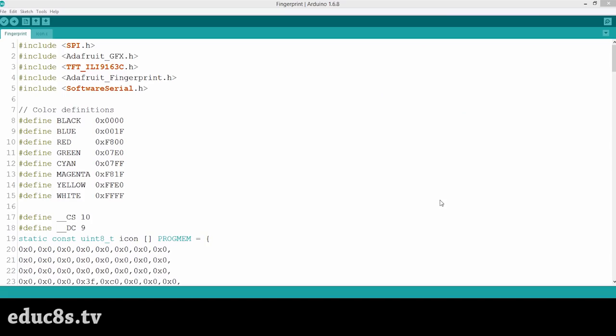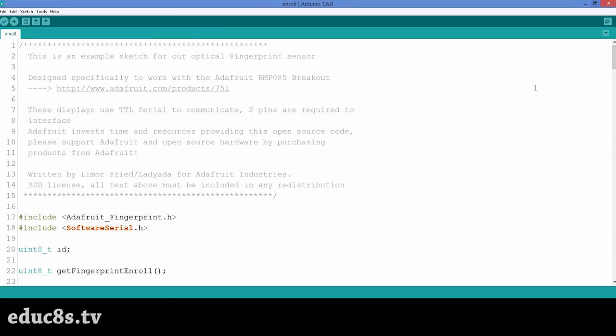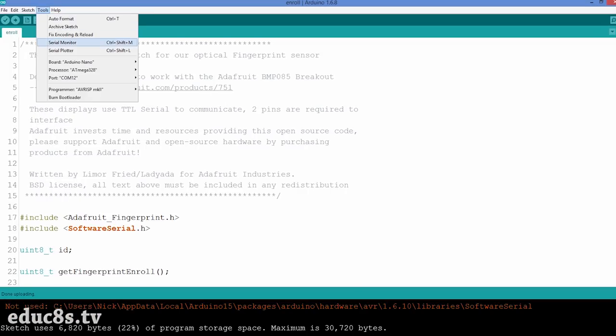We need to download some libraries. First of all, we need the Adafruit Fingerprint Library, the Adafruit TFT Library, and the Sumo Toys Library for the display. You can find links for all the libraries in the description of the video. First of all, we have to upload the enroll example to our Arduino board. We go to File, Examples, Adafruit Fingerprint Sensor Library, Enroll. With this example program, we can store fingerprints in the flash memory of the module. We upload the sketch and we open the serial monitor.